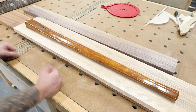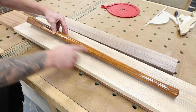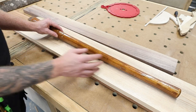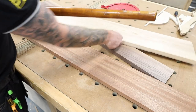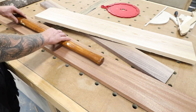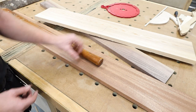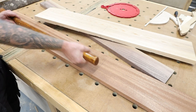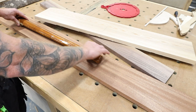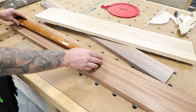We're going to make something a little bit nicer with more detail - a laminate piece with a stripe down through it, similar to the guitar necks I've built in the past. The outsides are going to be sapele, then a center stripe of walnut, and either side of that a nice white ash stripe. I'm going to change the design just a little bit - it's a nice straight one that flares a little bit at the end so your hand can sit there comfortably, and I'll put a little hook head on it, almost like the handle of an axe.